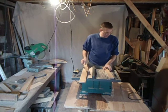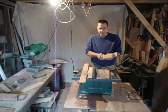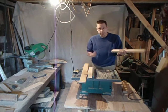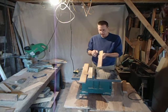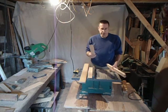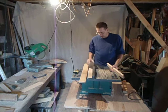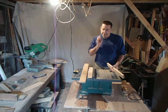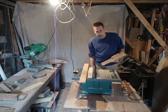Hopefully I don't cut some fingers off because this will become a horror show very quickly. I've already ripped down three of the four pieces that I need for the stiles on the upper cabinet face frame out of thicker material. This is the last piece, and that's when it occurred to me I could put this on video. I'm going to rip it down to about three quarters of its thickness. I've already laid it out and marked the size I want to take off. I always use a push stick — just a cut-off piece of material — so I never get my fingers near the blade. My golden rule is that once my thumb hits the front of the saw, I don't let it go past that. I always keep my fingers away from the blade; it's extremely dangerous.